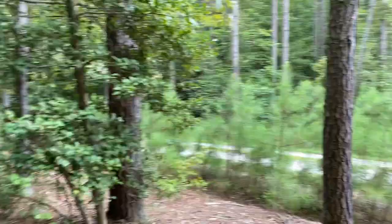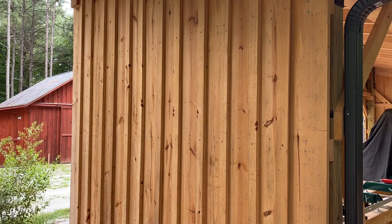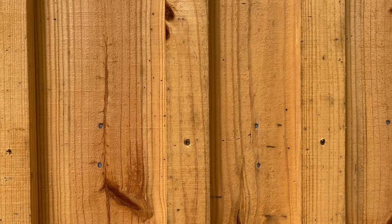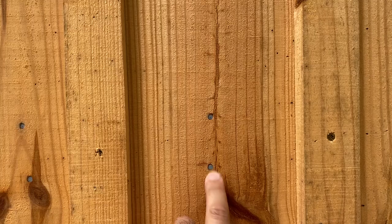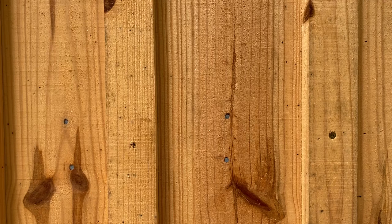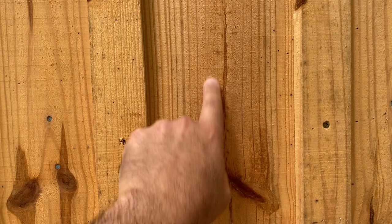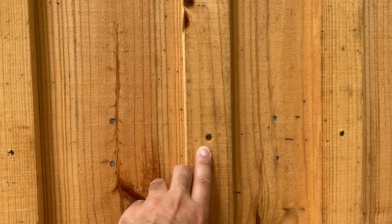If you're going to be siding with green lumber, the board and batten method is really the preferred way to go — it originated to deal with all the issues you run into with green lumber. The way I did mine: there's a row of fasteners here, and behind this row is a wall girt. For each board I came in dead center on the board and put in two ring shank galvanized siding nails with a nail gun. That's the only place these boards are nailed — down the middle. There are no nails on the edges of the boards, because we want to allow those edges to shrink in as the board dries out.